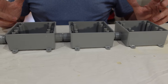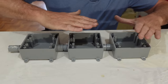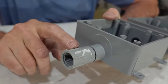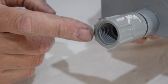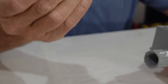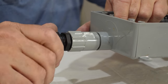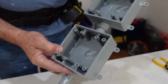We are all glued up. I was pushing down on the table so that these boxes are perfectly flat and in plane — very important for our next step. On this end where our cords are going to go, I glued on a half-inch female adapter, which adapts from the glued PVC on one side to half-inch female pipe threads on the other side. I can now screw in my strain relief, which has half-inch male pipe threads. Way down here by the shoulder there's an O-ring that's going to seal against any moisture. Let's tighten that with our channel locks.